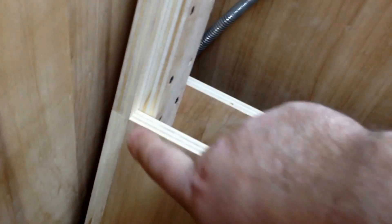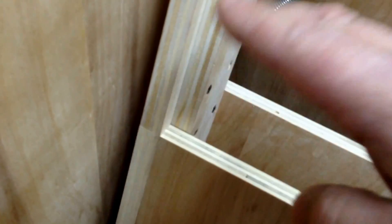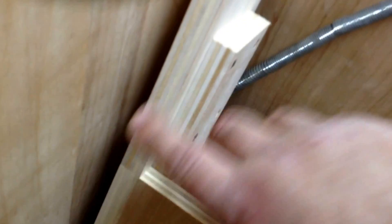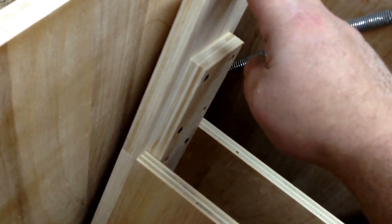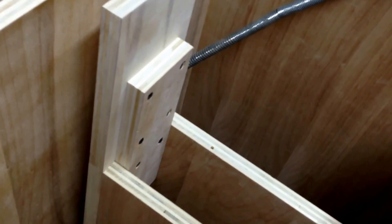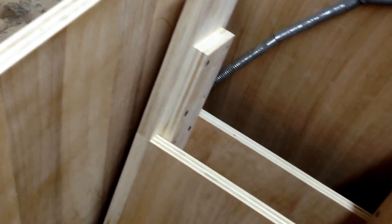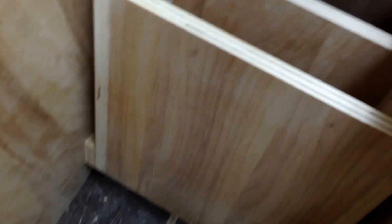You can see where I added my extension on — this was the original box right here, and it just made the fit inside there. When it was right to the top of the motion, there was a little bit of play, so I just added this extension on. I very simply patched a piece onto the bar on the inside and ran this up, and that made it a lot more stable. If I was to do it again, I'd just have this piece cut the same length as the outside box. Then inside, I just had to put a little patch to bring it out even, and then a bolt runs through for the pivot point.